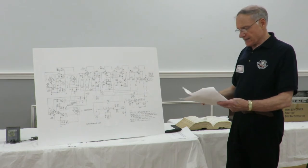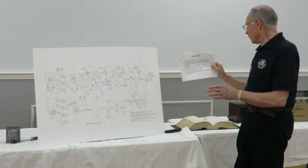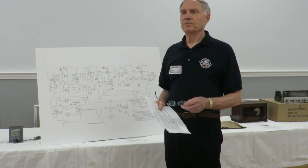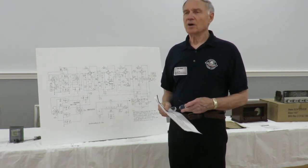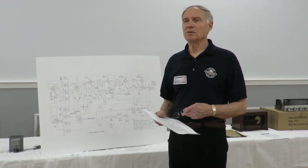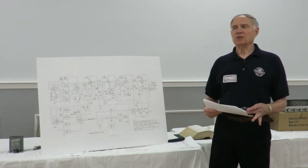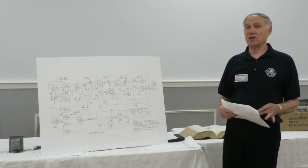Let's see. I think what we could do now, if there are no more questions on that, we could go to the... Just a quick question, yeah, on the power supply. I'm just getting into this and kind of new to it. I don't have a variac, but I'm going to build a dim bulb tester. Sure, that's good, yeah. Is that a good option to use? Yeah. Protect the radio as opposed to if you don't have a variac? You want to have some way to limit the potential for high input current into this radio.